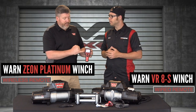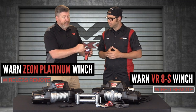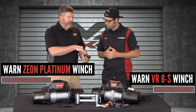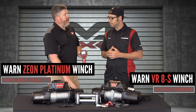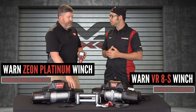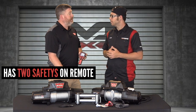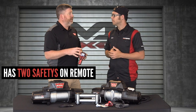You'll see here real quick, you've got your gear train on the left-hand side of the remote. You've got a battery and you've got a temperature gauge. So as soon as I hit that button, those gear trains separate and they actually show — this one's showing an error message right here because one of the safety features of this automatic clutch. You might think: what if that winch clutch fails and stays in open position? Well, it cannot. It has two safeties on it. As soon as that gear train turns, it's going to drop a pawl on the gears and stop the rotation of the gear train so it cannot run away from you.